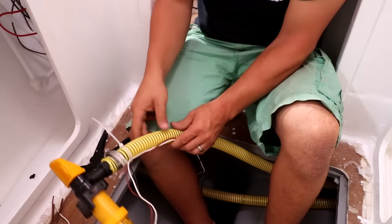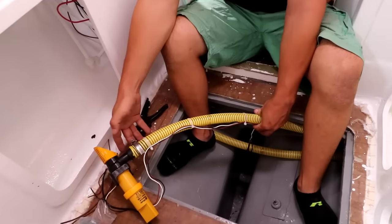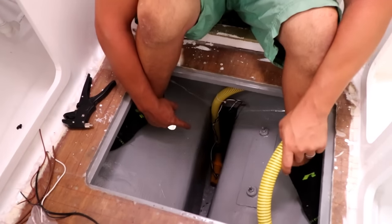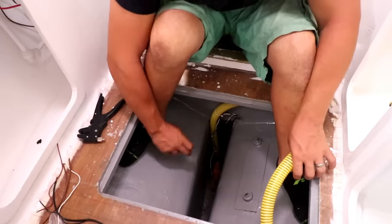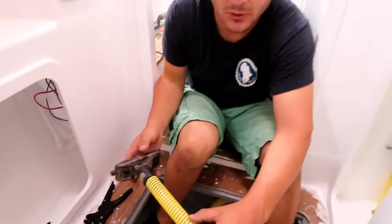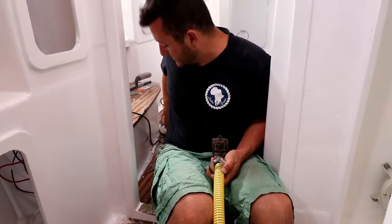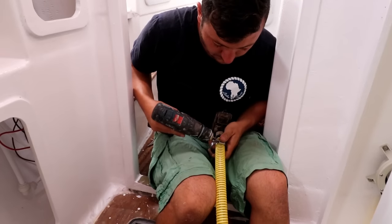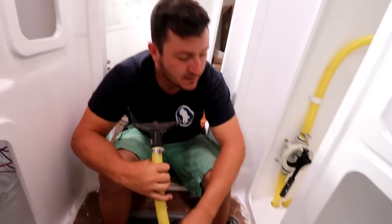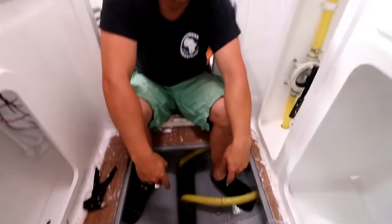Don't zip tie or use cable ties to crush the wire — it's just to secure it. It's all nice and neat, strapped up with cable ties, and then that will go straight into the bilge. We also connect that cable to a bilge alarm, and here goes the thru-hole going in there. This one is for the manual. If you're Portuguese you'll understand this — not automatic, al manual. For manual, we just make sure that there are no leaks because if you've got leaks she ain't gonna suck. So in this cabinet we've got our manual bilge pump — yep, sucking. So al manual will go into this bilge also. Automatico and manual lived happily ever after.